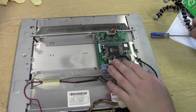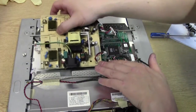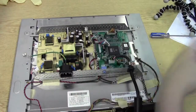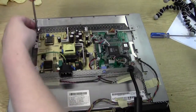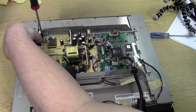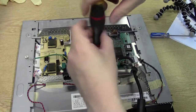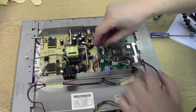We're back, and let's sit this board in. So make sure all of your wires are out of the way, they're not going to get trapped. Slap the board in, push it down, there we go, done. What I'll do first is just maybe screw in 1 or 2 screws just to make sure the board's in place. We can switch it on with the cables plugged in and see if we get any life out of this. Okay, that way we don't have to unscrew absolutely everything.